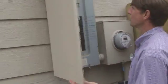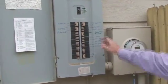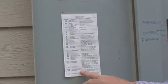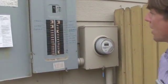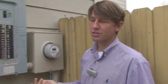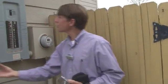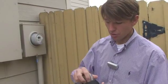We're going to open up the main panel and take a look at a couple of things here. This is a 200-amp service panel, meaning Dave has 200 amps worth of service. He has a bunch of breakers — here's the full description of all the different breakers and where they go. To tie in a solar system to the main service panel, we typically need one 30-amp breaker. One of my foremen, who is also a master electrician, would look at this and say we can combine these two and open up one 30-amp breaker and tie in right there — no problem. This is almost the perfect setup for a solar array for the inverter location.